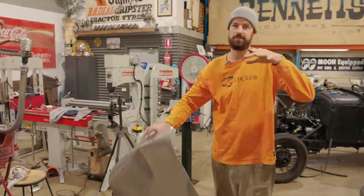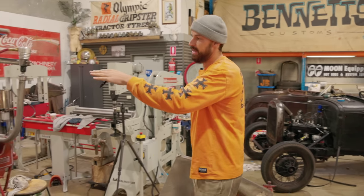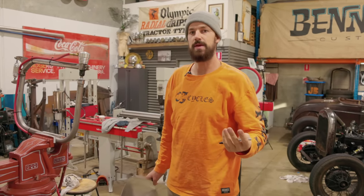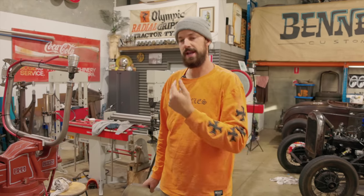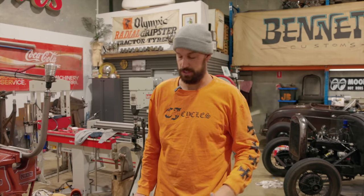So there was a bit of stress happening, like I was trying to mention, thinking that I could just lightly planish that area and stretch it. But what it ended up being, and I think I mentioned it before, was I didn't have enough tape on that top wheel. So I was getting a three-dimensional shape where I only wanted a two-dimensional shape. I probably didn't have enough tape on the wheel. I don't have an upper rubber bit for that, so I usually just use tape.